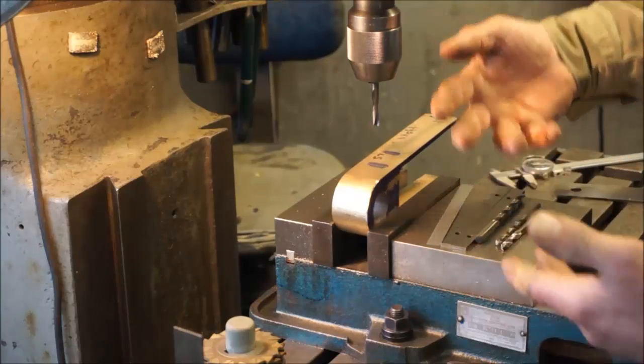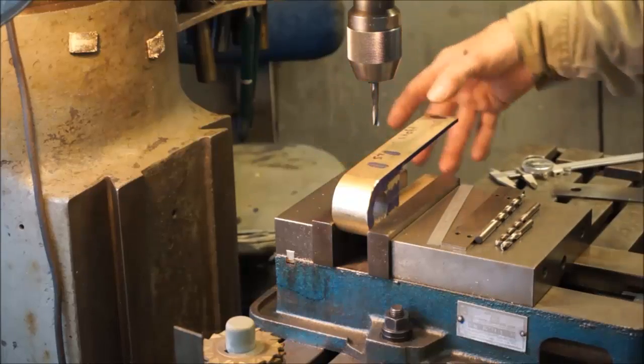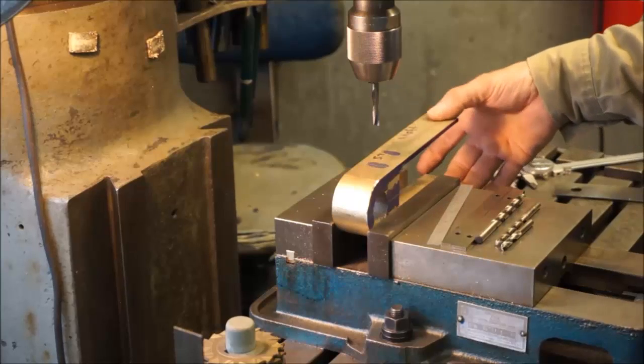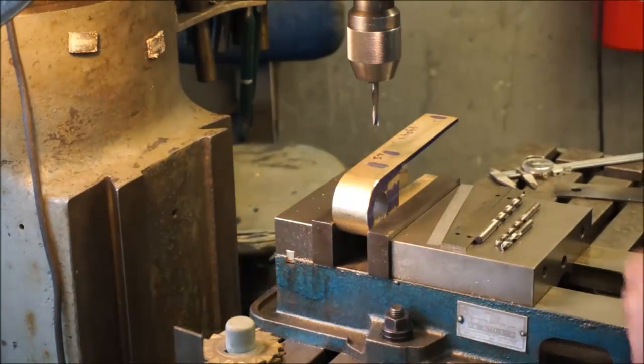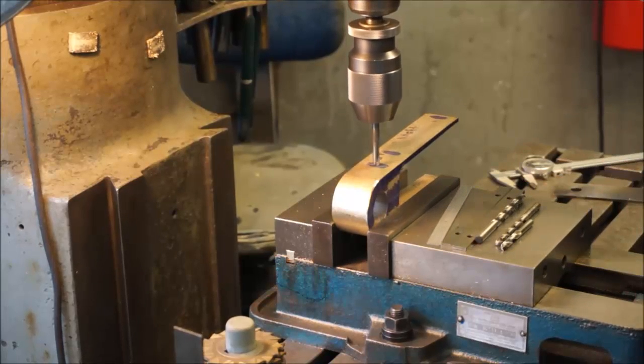So all the screws will go in from one side, and they'll be different lengths because of this width difference from start to finish. Then it'll be finished off. That's their job of getting the fasteners and all that. So I'm just following the drawing, and then we're going to have to get a dummy bolt in here so that we can do the finished boring when we're all done. Alright, so I'm just explaining that real quick while I go ahead and knock out these holes here.